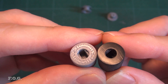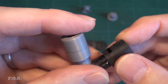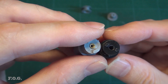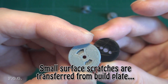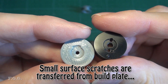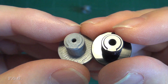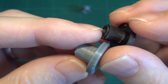Here is the main winding shaft. There's a little bit of shrinkage and lifting on the bottom, but overall compared to FDM there are less layer irregularities and naturally no layer seam, though I wouldn't go so far as to say this is a nice finish either. The finish of the top however is pretty good and the little locating pins came out nicely. This is the shaft side part of the bobbin holder — again we can see some shrinkage on the bottom, but the detail on the top side is pretty nice. The tiny bobbin locating pin here would have been impossible to print in FDM. The outside piece of the bobbin holder is also very nice and clearly better than the FDM version.